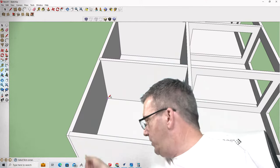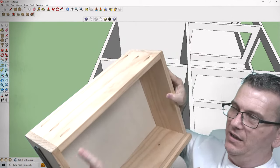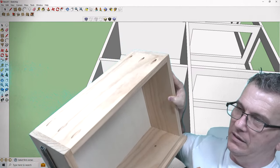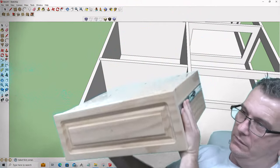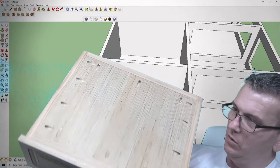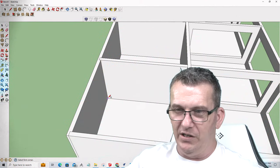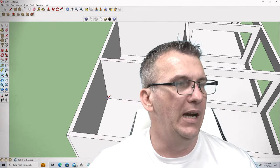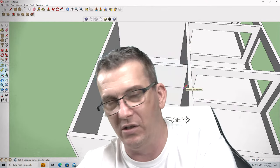Those drawers, just so you can see the construction on those, because I'm still up large, I'm not small, they're just no fancy joinery, right? They are pocket hole screws and everything, made out of a select pine. They're stout, and then the bottom is pocket holed in. Again, this is a workbench. It's not going in my master bedroom, right? So that's going to be the joinery that I use, quick and dirty joinery. So on that particular drawer, that's a 6 inch tall drawer.